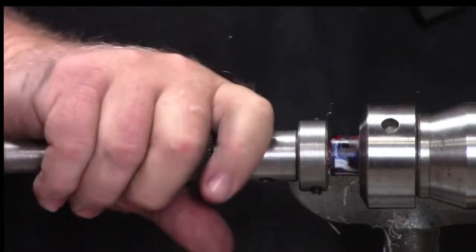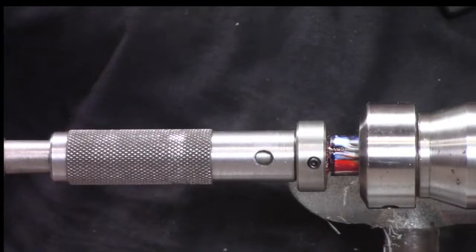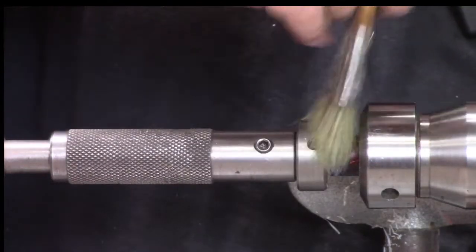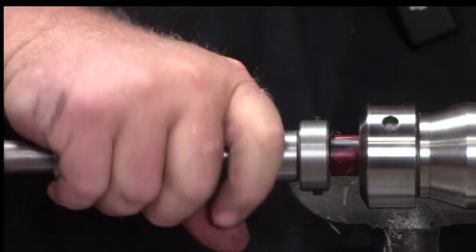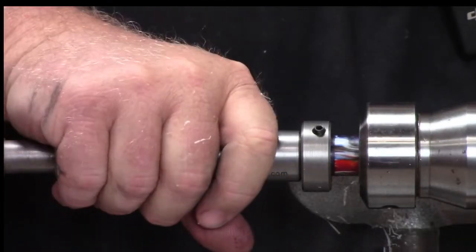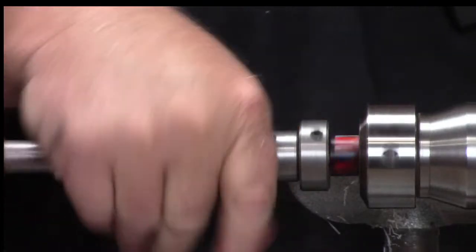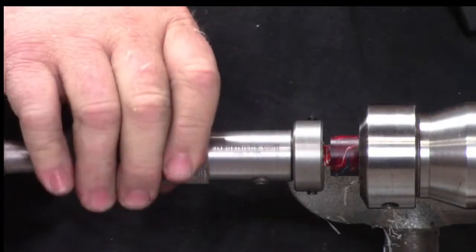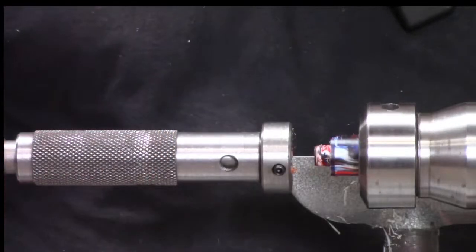All right. Back up a little bit. Try to clear those out. Some of them are just going to stay in there, I guess. And then we'll go all the way up to the shoulder. Now be careful. You've got a relatively thin piece of plastic here with these threads. So if you keep trying to twist, it'll probably eventually snap off. All right, that looks pretty good.